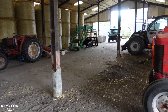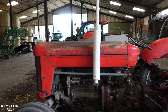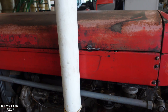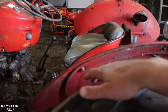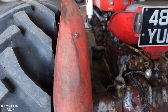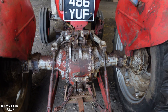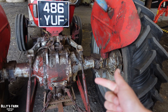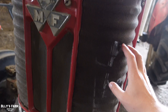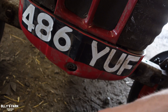In the morning daylight it's looking like quite a good tractor. We can see that the bonnet's in original condition, so are the back mudguards. But there are quite a few things which will need replacing - the mudguard frames are in pretty good condition, but the mudguards themselves are not; they're going to need to be replaced because they've rotted at the bottom. There isn't a top link either. The bonnet is completely genuine, even the grille, except this bottom piece is not original - it's a remake.